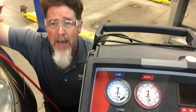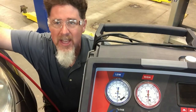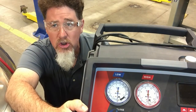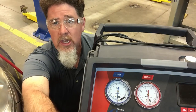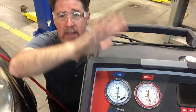If I look at this gauge reading, I can't tell if that's 30 inches of mercury, 29, or 28. If someone didn't calibrate this gauge for altitude and you're a thousand or two thousand feet above sea level, that's enough to be maybe one or two inches of mercury off. So it's pretty important to know if this system can evacuate down to 29 or 28 inches of mercury.